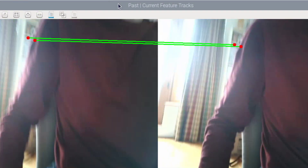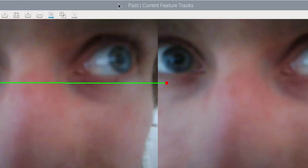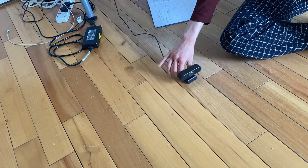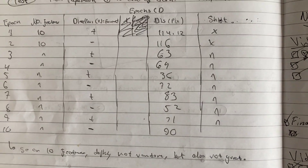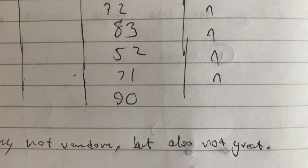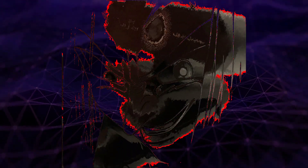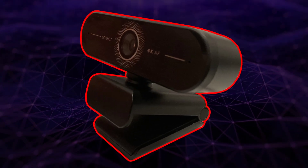This is what that looks like — it's what the rover sees, and it looks like, well, crap. But it does give us fairly accurate pixel values. When I say fairly accurate, I mean that across 10 iterations of testing the exact same movement of my camera, my total pixel change fluctuated by about 40%. This change is largely due to the feature tracking initially starting off at different points. This inaccuracy just kind of seems to be a problem with monovision systems — which just means one camera — and they aren't all that accurate for distance perception.